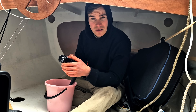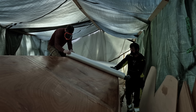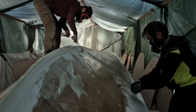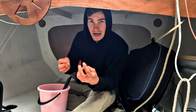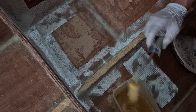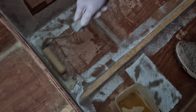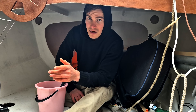There's no leakage — it's just coming from the hatch which I have now improved. Looking at the completely wet surface, there's no damage yet even though I haven't really cared about water tightness too much on the inside of the boat. I've just covered most things with one layer of epoxy and there's no mold, no water ingress whatsoever. The bottom of this hull is first covered with a thick layer of epoxy on top of the plywood, then two additional layers of over-soaked glass fiber weave at 500 grams thickness, topped with three layers of epoxy paint and a final layer of hard epoxy paint. That makes for a very waterproof surface, and because the inside of the bottom is almost completely exposed, there's very good ventilation as long as we don't get moisture from condensation — but that hasn't been a problem yet. Maybe in different climates that will be a slight problem.